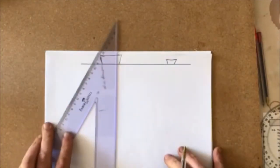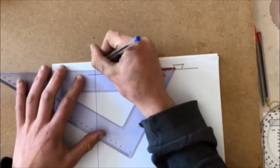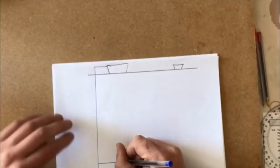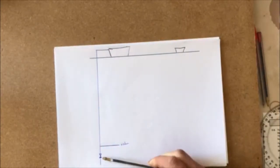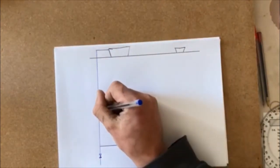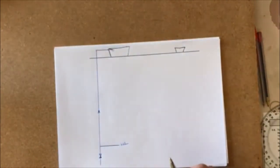I'll go through this now as I explain it. What we have is cold water running up from the ground. This is running into your house, and usually it goes up the back of the sink. So you have your kitchen, there'll be an off flow here to your kitchen, and there'll be what we call a stop valve. It kind of looks like an egg timer. Basically that is just a tap that you can turn off if water's flowing in. So at the start of your house, if a pipe bursts somewhere, you can go down and turn off the stop valve there. So water flows into the kitchen, you've got your mains coming up, and then it all goes into a ball cock tank up in the attic.